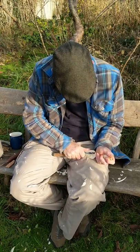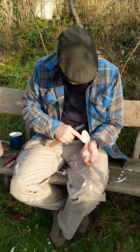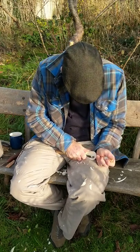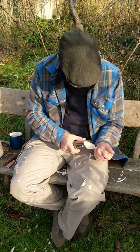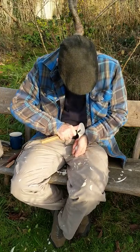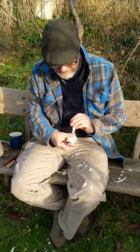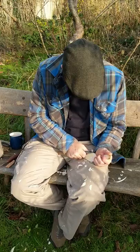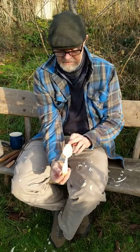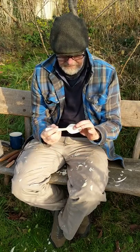Getting as thin as I want to go now. I can clear out across where I've got the fluffies, then work in around this corner — present the knife this way, work back around across again. That corner is easy, it's just a pivot. I can see the sun through that — there's a bit of a thin spot there.